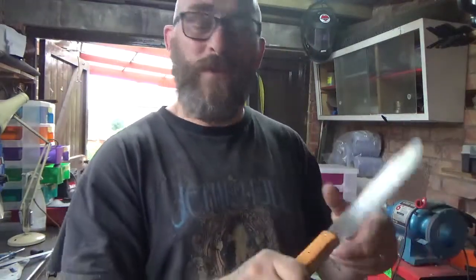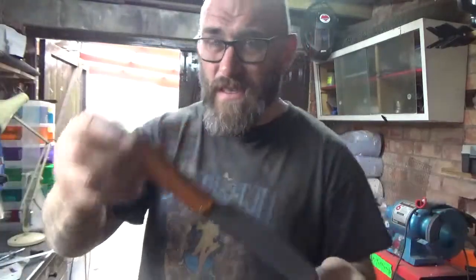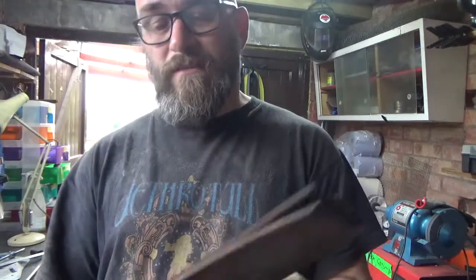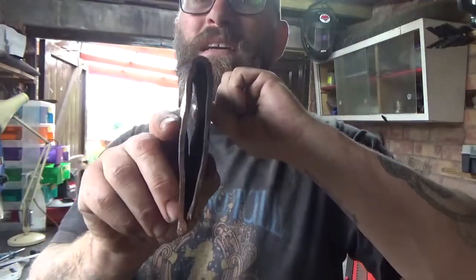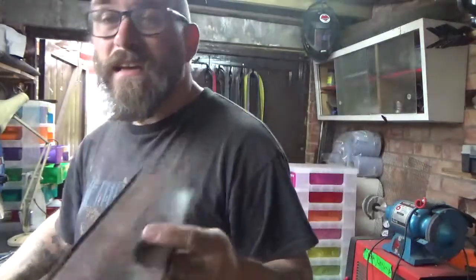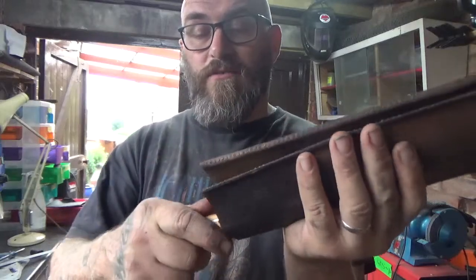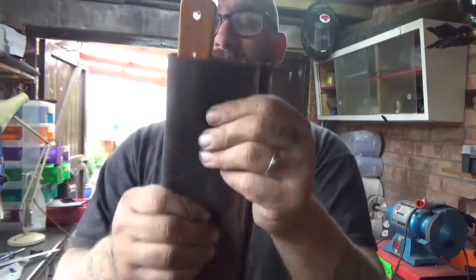You can do a bit of chopping with it, put a lanyard on it — patina blade. I've cut up the old sheath, put some leather oil and leather cream on it, soaked it in water and flattened it between two pieces of wood. I'm going to let that dry and make a sheath out of that. If this blade's any good — needs sharpening at the moment, it's blunt — I'll use the actual old sheath to make a new sheath.